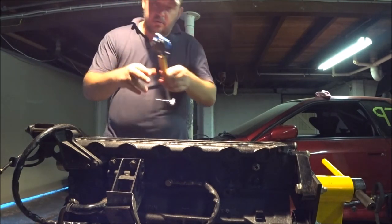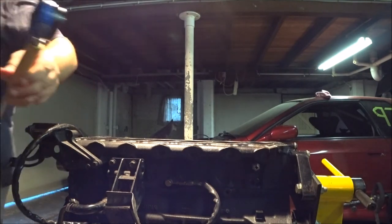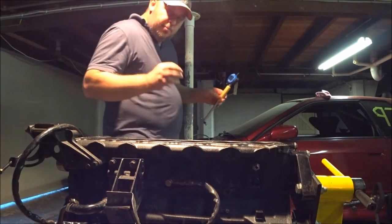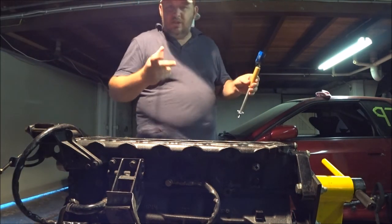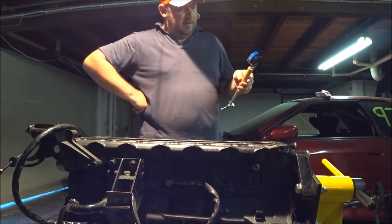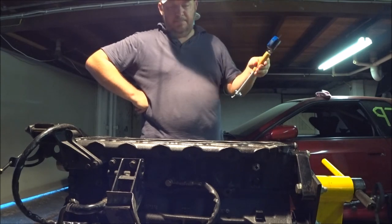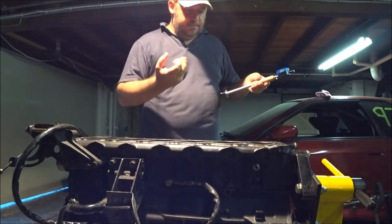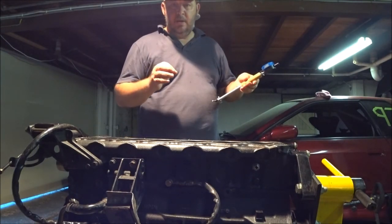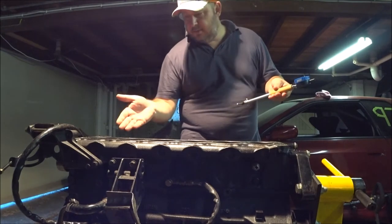There's no asterisk in front of the number. It is .076 millimeters smaller than 86, which doesn't seem right. But that's just a test to get the functionality of the tool. I'll have to triple check that I had the measurement right on the micrometer for the calibration, because that's the most important bit. If you don't get the calibration correct, you're not going to get any accurate measurements on your job at all.